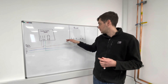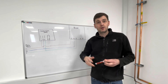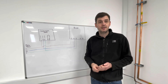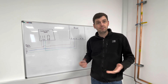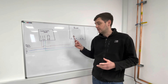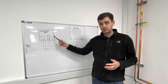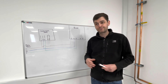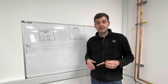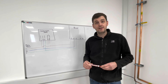If you just run a live, neutral and earth and don't put the live wire through the black wires, then eventually one day in the future that condensate pump will break. When that happens, the condensate level is going to rise and rise, and because we've not wired it via this float, that float is not going to have any effect - so we're always going to have a live feed to the boiler and eventually the condensate pump is going to overflow and you're going to get mildly acidic water all over somebody's floor. Worst case scenario it's up in a loft, taking ceilings down and so on. That's the importance of utilizing all five wires on the condensate pump, not just the live, neutral and earth.